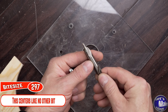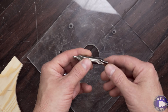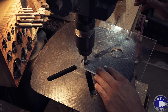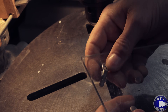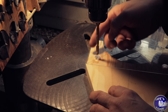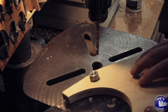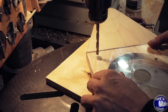I will be using a center drill bit but this is going to be a little bit too small, so I'm going to start it off with this bit — all these bits are going to be on the website so it's easy for you to find. Then I'm going to switch to this other countersink bit which should get me to the half inch that I need in order for these to sit flush. I've lined this up over my mark, got a clamp on this side, and I'm going to use a twist drill bit to drill this out.